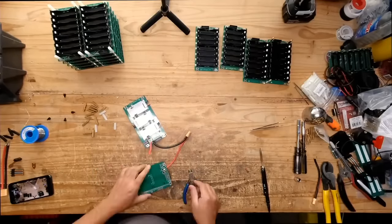So that's the thing about my boards. They're very safe because they have multiple layers of fusing everywhere. So this is great for beginners, because they just blow fuses and they won't hurt themselves, right? But then they might get discouraged because the battery doesn't work. As you will see here, I myself blew some fuses while I was building this. I don't even know how, but it's a good thing. Fuses blown is a good thing. It's kind of a hassle, but it prevents you from melting stuff and hurting yourself and maybe making your house catch fire and stuff. So, there we go.